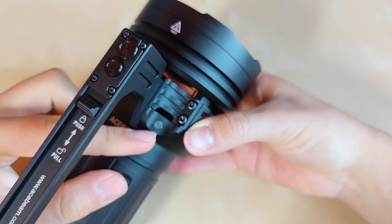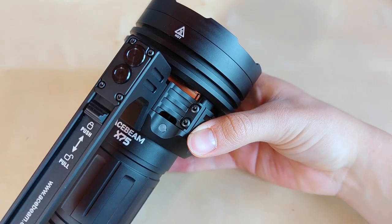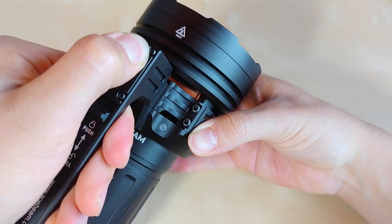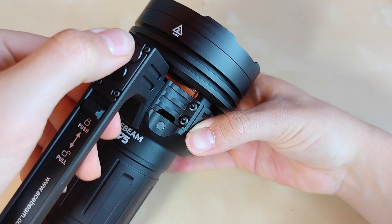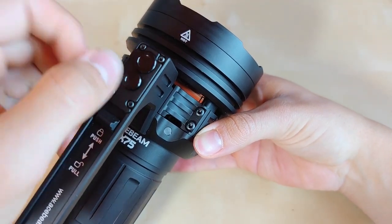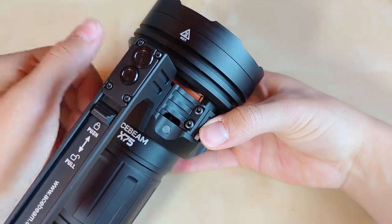When it goes 3 times red, it means you've got non-windy mode, which is dangerous, not okay, all right? Red light. And then press again for 3 seconds. You've got 3 green blinks, which means okay, good, you are in the windy mode. And the third function of the auxiliary switch is changing between the power mode and eco mode, all right?